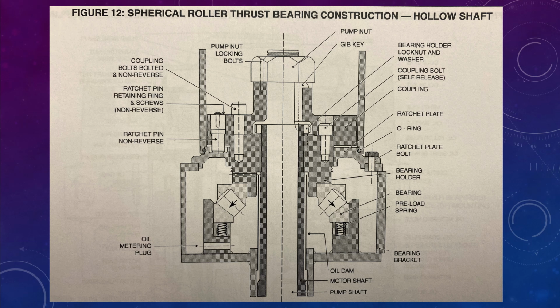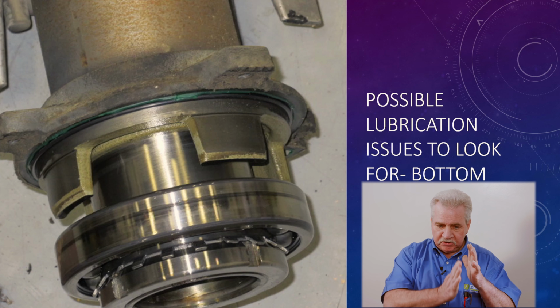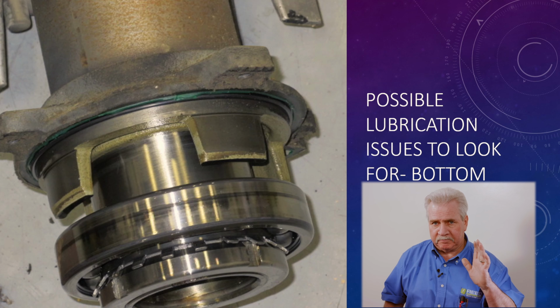So where I'm going with that is we have the machinist here take a depth gauge and take a measure from the top of the finger down to the face where the O-ring is at in that picture. So it's flat right there. And they measure all 3 or 4 of the standoffs to make sure they're all the same. If they're not, set up the cap and make sure you clean those up and then clean the face the same amount you took off the fingertips.